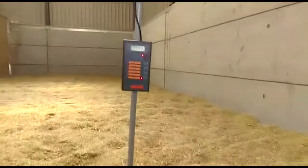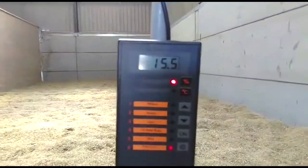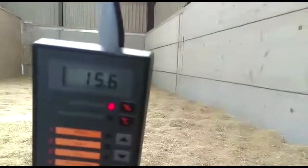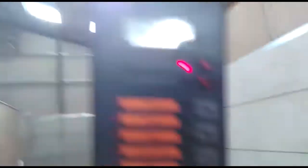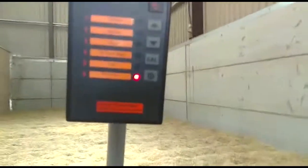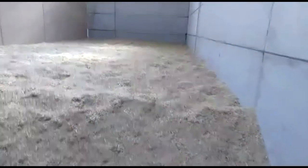I've just put my spear in it, having had 24 hours of drying, and we can see that the spear is quite low down in the heap, and it's showing 15.5%. So it has dried down a lot in 24 hours. But if we take a reading towards the top, you'll see that the moisture content is still 24-25%. The reason for that is that the air is coming up from the bottom to the top, so it's actually blowing the moisture up through the heap. That is why it's important to stir the heap every now and again, because even at a metre deep, the fans will have a job to push the moisture right through and out the top. So it's important to manage these grass seed drying facilities to make sure that the drying is done right through the whole heap.